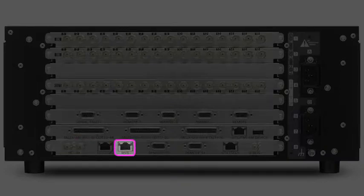And lastly, right here is the single LAN connection. This is the one marked MVS. It's a Cat5e Ethernet cable, and it's going to run from here over to the MVS 3000 panel. Now, these are Gig-E Ethernet ports, so there's no need to have a special crossover cable or a crossover adapter. It'll automatically happen when you connect them.